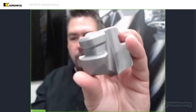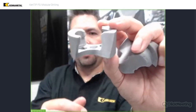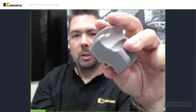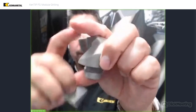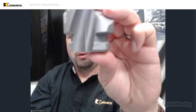What I want to show is how this tapered surface goes together. We've got two parts: the insert itself, and on the other side, the top of the steel body. One of the important surfaces is the bottom surface, but especially this surface right here — this is kind of your axial drive. That's really where you're able to provide your thrust force. You've got these tapered sections in here which match up with your body to help lock it in place.